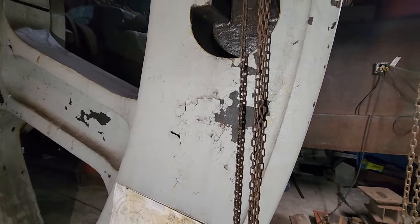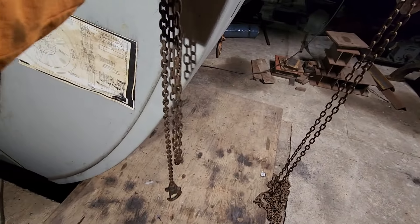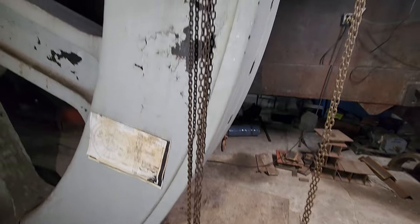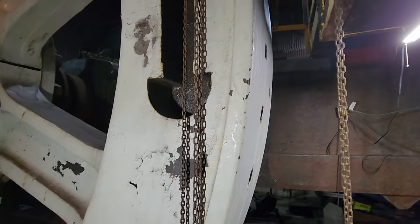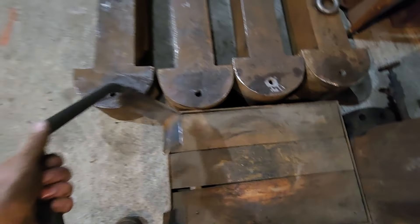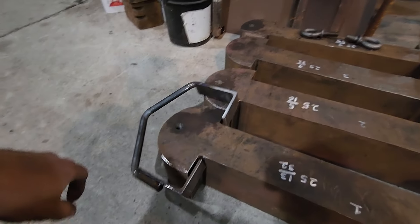What we're going to do on Saturday is bring the links in and heat them up one at a time. I've got chain falls — one on this side and one on the other side. I made up a hanger that will lift the link up in place, heat it up right here, and then once it expands enough to slide in, we'll push it the rest of the way in. I've got this hanger made out of some bar stock and angle that goes right there, so we can pick it up straight.